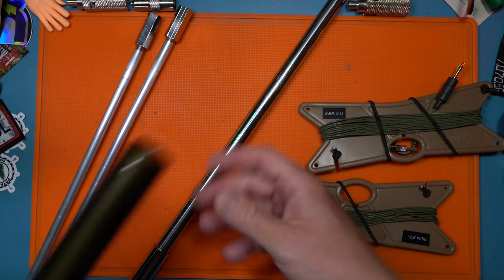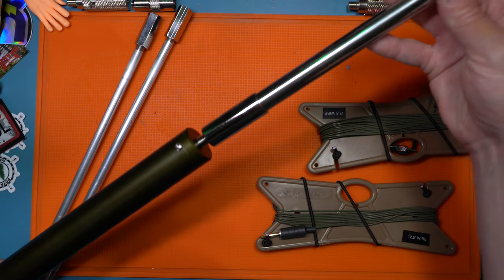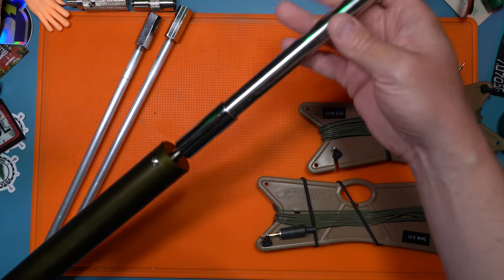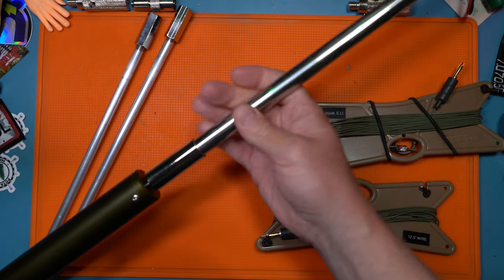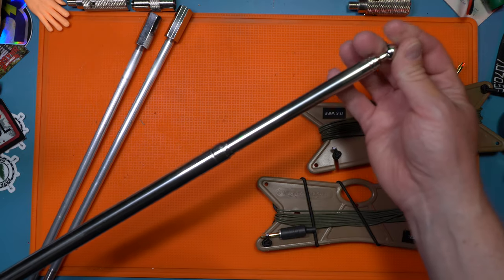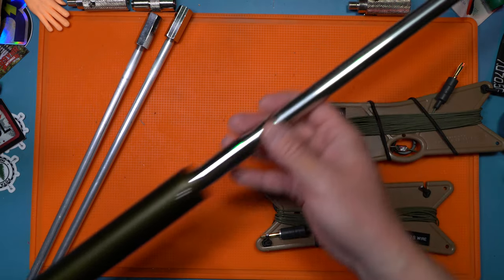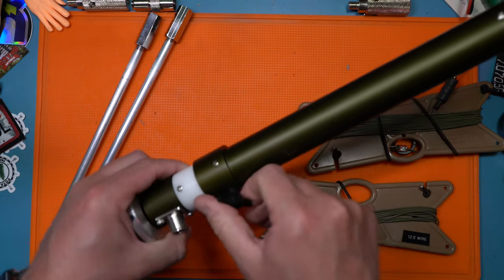Then you come back around to the top of the spike and you add their new customized vertical whip. That's pretty much your whole antenna. You just add radials and extend the whip out all the way — that gets you on the air, at least until the point that you need to make fine adjustments on the coil.